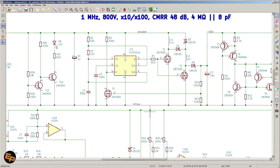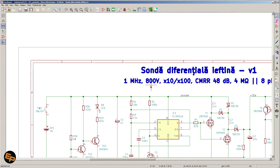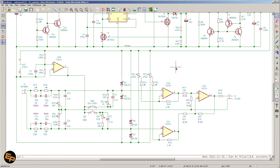Now, before I go into how I've built this, let me show you some performance results so you can better understand how good this differential probe is. When you build this, of course we will want to build the power supply separately from the rest of the circuit so we can test it and make sure it works separately. We can look at a few things besides the fact that it gives us plus 31 volts and plus 26 volts. We can take a look with the oscilloscope to see finer details — for example, the ripple. This is how the voltage looks at the 26 volt output after the linear supply circuit with no load whatsoever. At 5 millivolts per division, we have about 10 millivolts peak to peak, with my oscilloscope showing about 3 millivolts RMS of ripple.